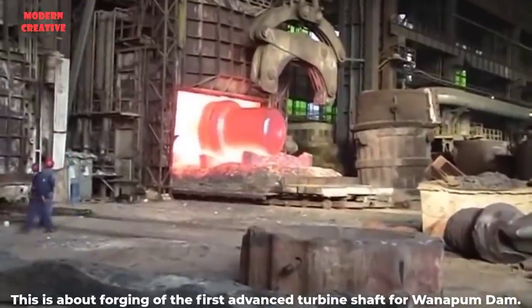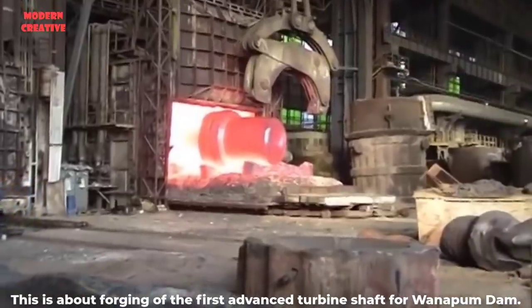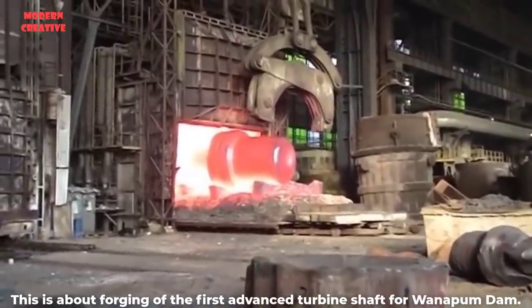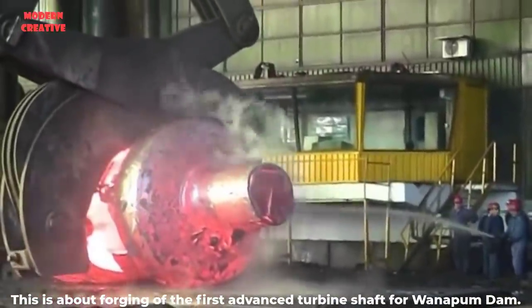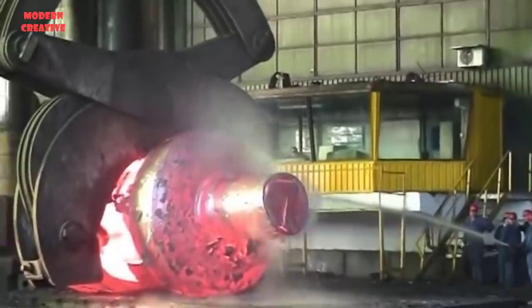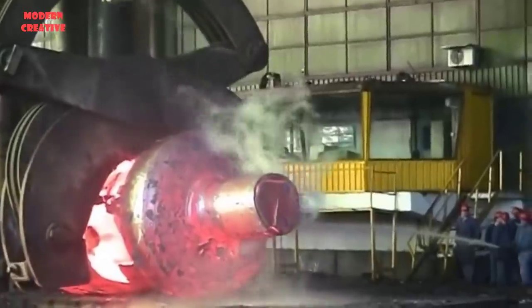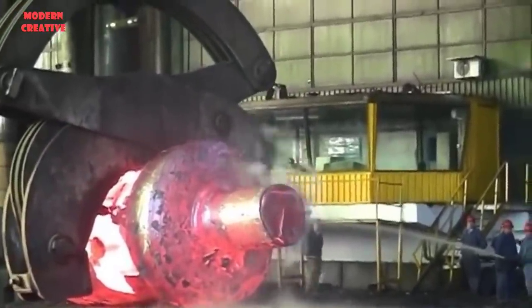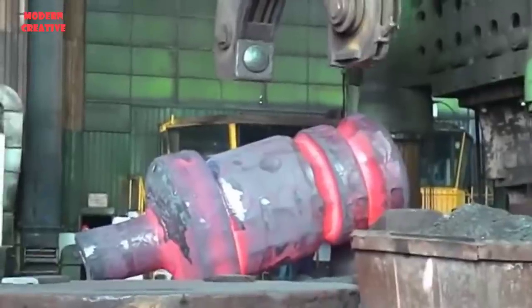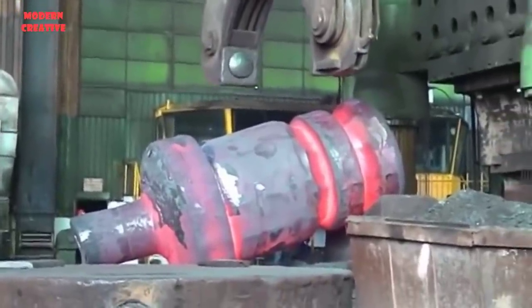Monday morning, and we're pulling our billet out of the oven to start again on the forging process. Pull off the stem area so it'll be hard enough to support the weight of the ingot as they're scarfing the other flange. Otherwise, it would bend and droop and they'd have problems. So here you see them trying to cool off the end before they put the mandrel on it to use it to hold things. Now that the flange has been scarfed on both sides, looks like they're going to go ahead and pick it up, possibly for a return to reheat.